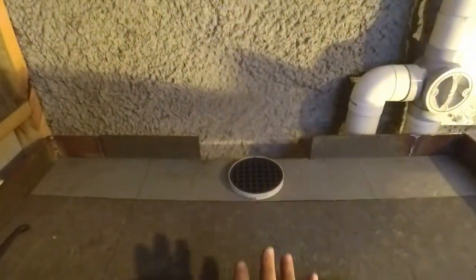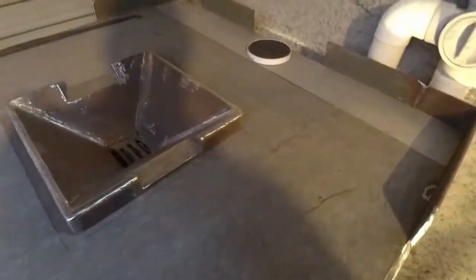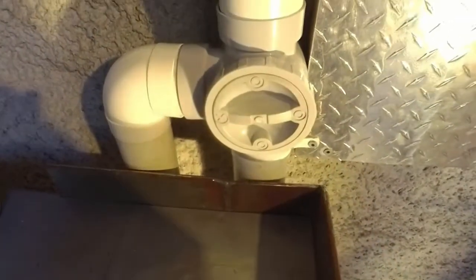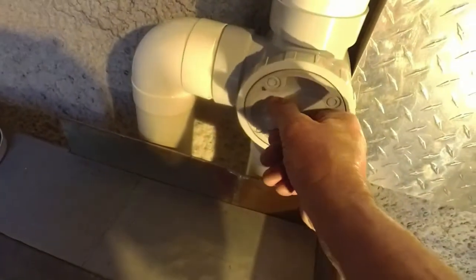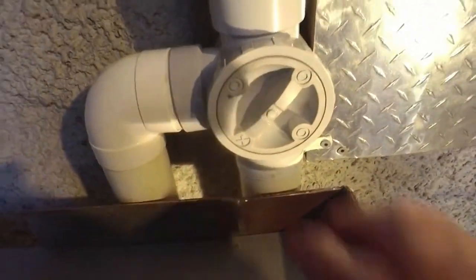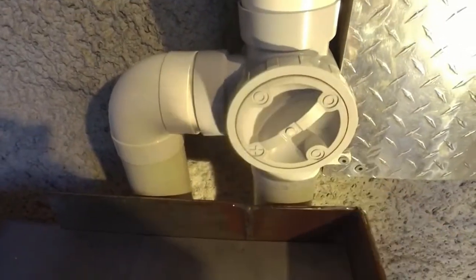So that air being pushed up through there will help to suck the smoke up through your flue before it gets hot. And of course, you don't have to have it on all the way. That's with the X fully down. Doing that, all of the air will be going down here, out through there, and up out of your fire pot. If you choose to, which is probably what you would do, you can put it halfway, or 3/4 of the way, or 1/4 of the way, whichever you fancy.